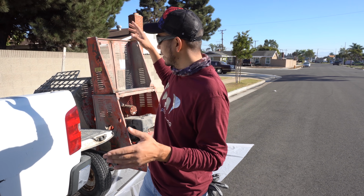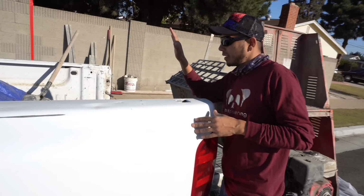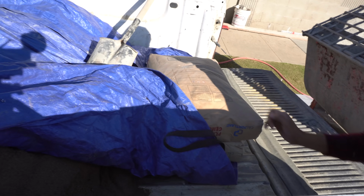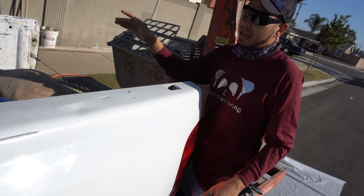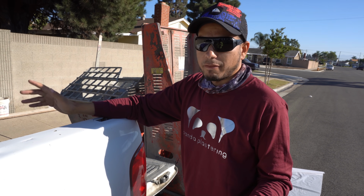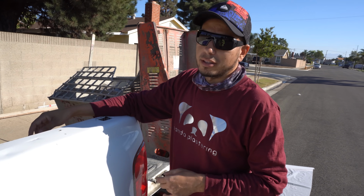In this part of the video, I'm gonna show you how to mix cement for your brown coat for your block walls. So we have plastic cement here, and we have washed plaster sand. So what happens is we're gonna do 1 bag of cement and about 19 shovels of plaster sand, and that should give us a good enough ratio to get it on this block wall.